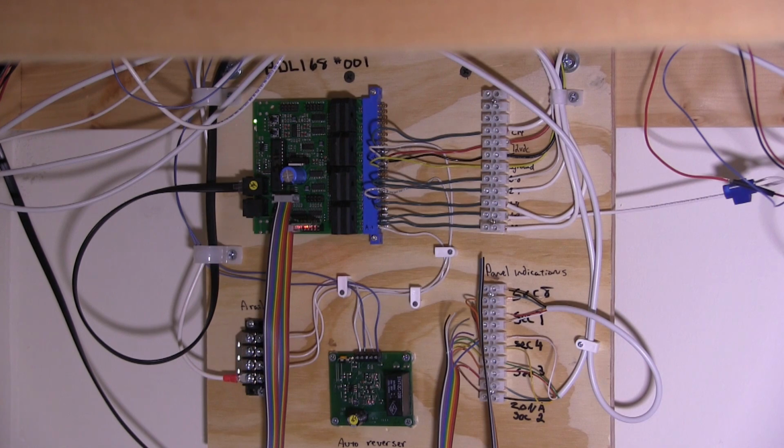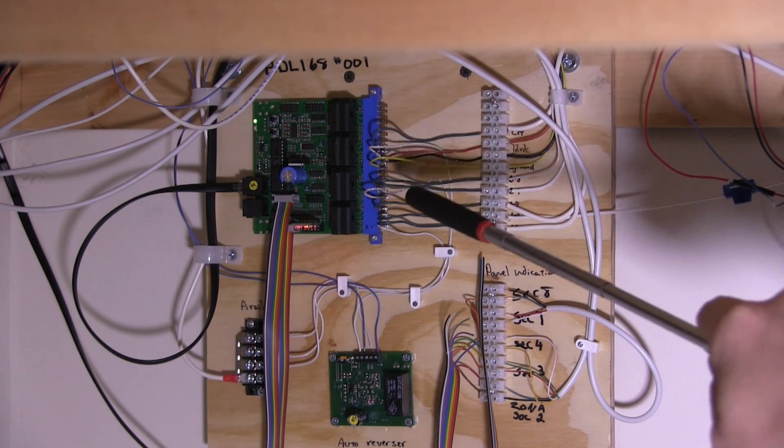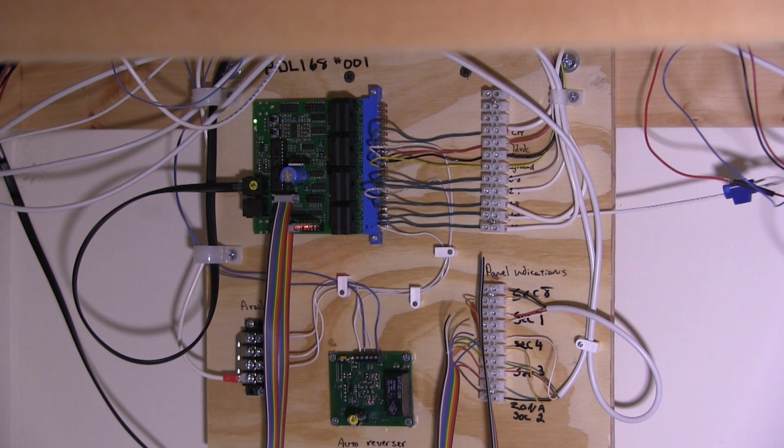Now the key, and this is very, very important. If you don't take anything away from this whole section, the very important part that I can relay to you is that yellow wire. That yellow wire is the ground wire, so that has to be run back to your booster and tied into the ground. Now, the edge connector has 2 rows of pins.